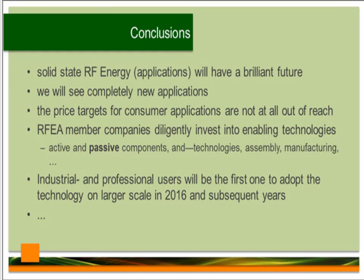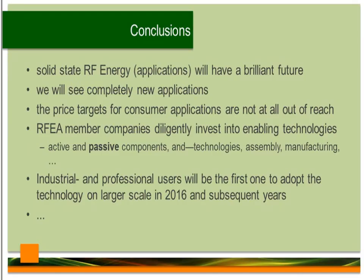But one also needs to take into account when selecting material how these materials are affected by temperature, for example. Some materials may have a significant change in dielectric constant versus temperature. So these are going to be operating at high temperature. If you designed it and optimized it in the laboratory and used the values of dielectric constant given at room temperature, but you're operating at 100 and 125, that's another area that is important to take note of, because you may find that the change in dielectric constant in some materials could be as high as 1 or 2% from room temperature to 100 and 125.